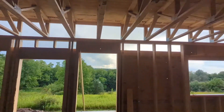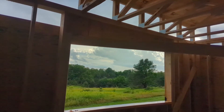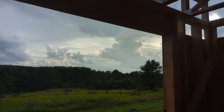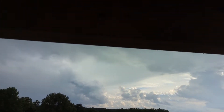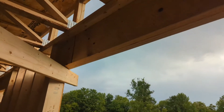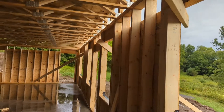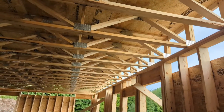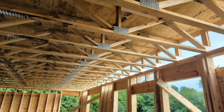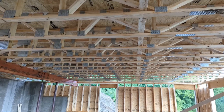In addition to that, you'll notice the headers — in a previous video I was wondering if they were going to be two-by-twelves, but they're actually not. These headers up here are also that LVL material. The lighting's not great, but you can see we have a couple of those put together here, because when weight is applied on upper levels, all of that weight is being distributed to that wall and to this beam inside of it.